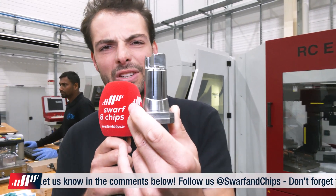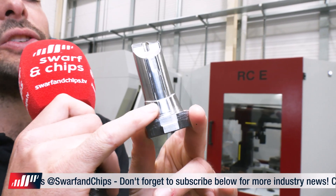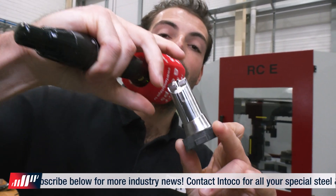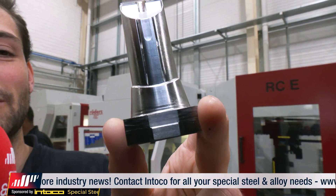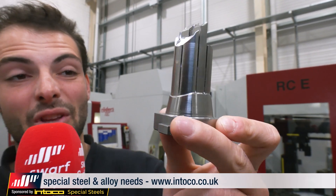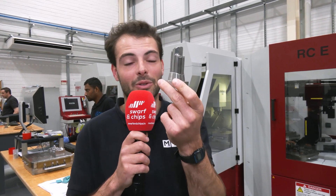If you have a quick look at the detail of this, the surface finish is incredible. This area is called a stop face — it's not part of the component itself, but it needs to seal against the shell that goes over the top of it. Because the plastic is at 1200 bar, you need not only a good surface finish to make a gas-tight seal, but a surface tolerance that means those surfaces meet really, really nicely. Consider that a watch might handle 10 to 20 bar — this material needs to withstand 1200 bar. You can't just stick an O-ring seal on it; you need real accuracy and real surface finish, and that's where roughing on the Doosan and finishing on the Roda's machines at Galway Tool & Mould delivers.